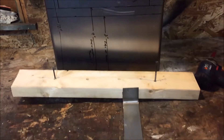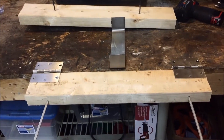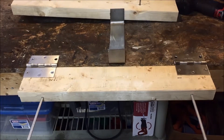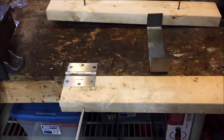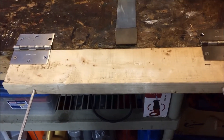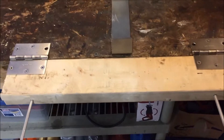I didn't have a sheet metal brake, but it really doesn't matter because I actually made one. If you want to make one, this is how you would do it — it's not that expensive, probably costing about five bucks to make. I have a couple of three-and-a-half inch door hinges on each side, a two-by-four cut about 20 inches, and a couple of gutter spikes in there for handles.